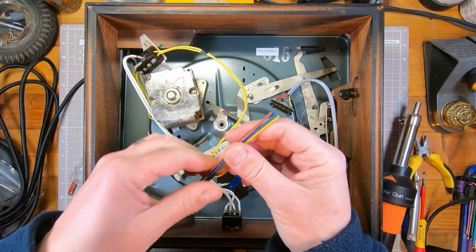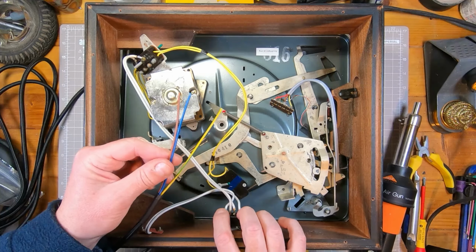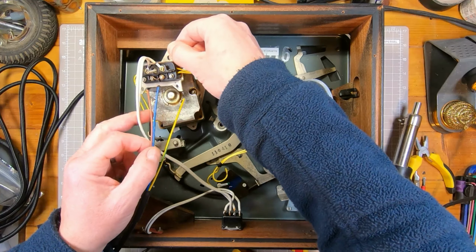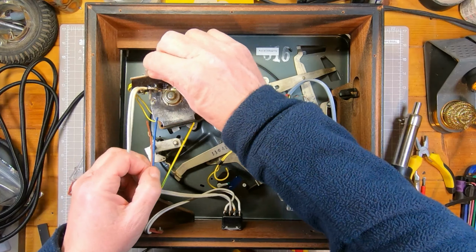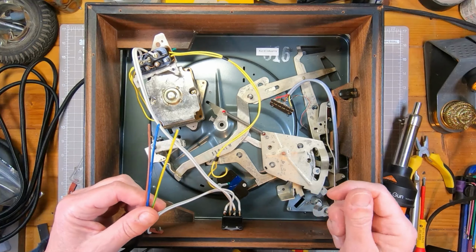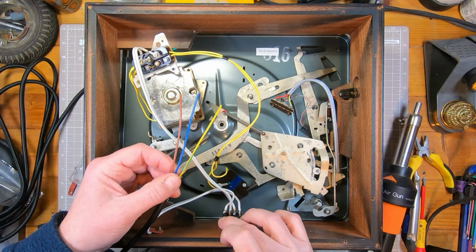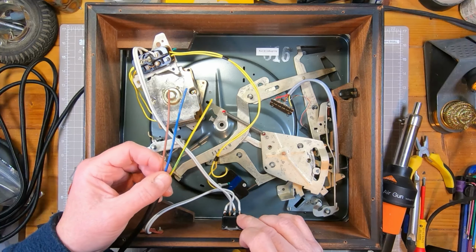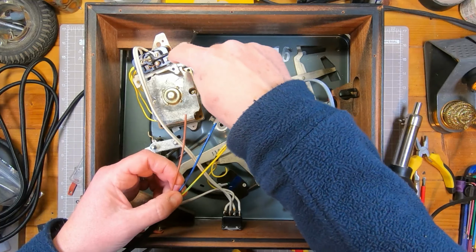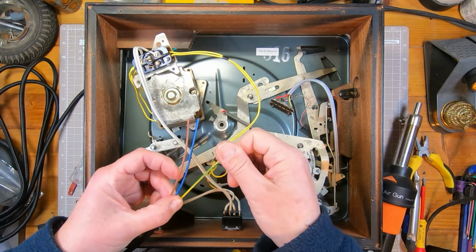Okay, so then we've got our 3 wires, so 2 there, and there's not even any polarity marked on the block. Obviously the original plug wasn't polarized anyway, so there's no polarity on it. So I can just connect live and neutral whichever way around here, run earth to there, and then run another earth up to here. So just get some earth cable.